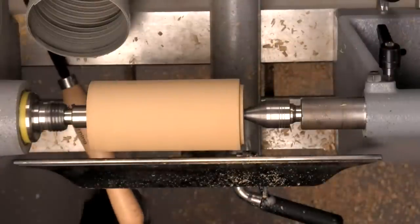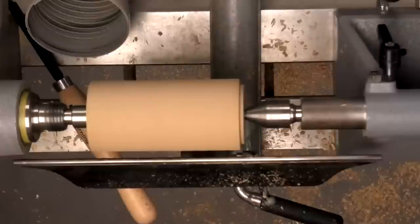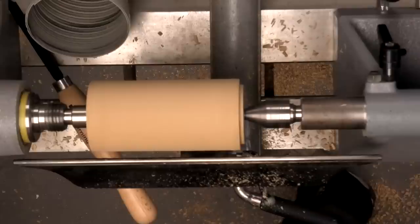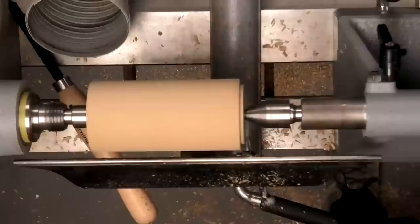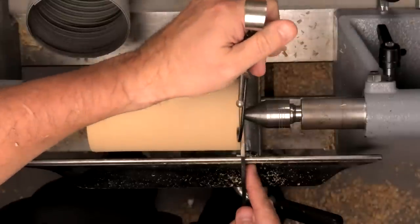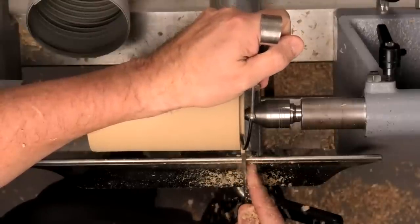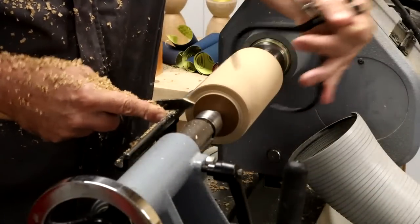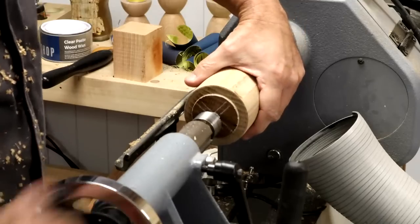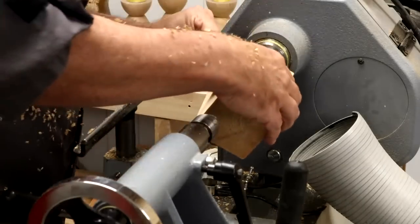So we're going to use a set of C jaws just to grip that. I've got my nice little Clubman chuck here, or the SK100. I'm just going to measure the internal, so grab a set of calipers. There we go. Now that'll do us. I'm not going to go overly deep. We don't need to go deep because we're going to use the tailstock as well. So first blank. Now we'll go for the softwood blank as well.